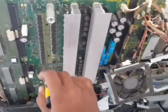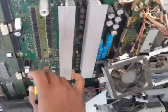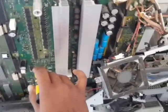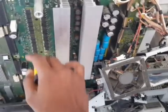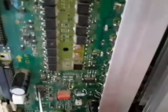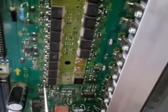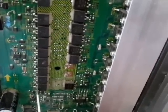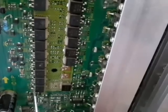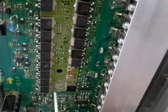The next suspect is one of these field effect transistors, because if they create a closed circuit between source and drain, that will short out all eight field effect transistors. What you do — you can see my screwdriver — is unsolder the drain and measure the resistance, or use your multimeter on continuity mode between those two pins.